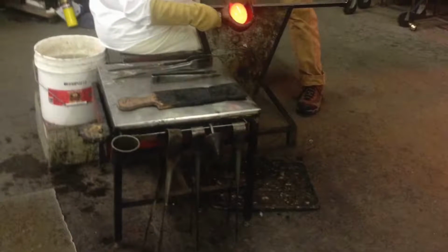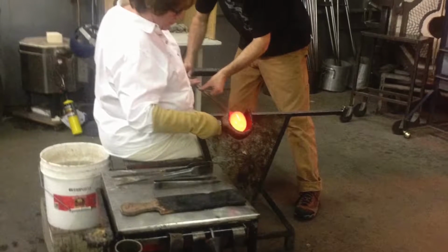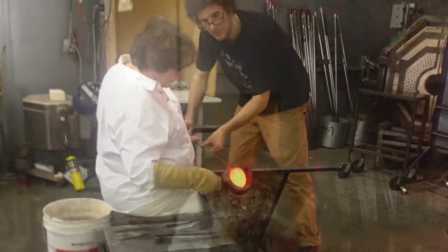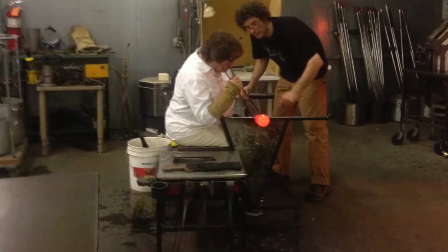Once you've started to blow the glass so there's air inside, you begin to shape it evenly in a wooden circle block that has been soaking in water and is nice and wet. You have to roll the pipe back and forth smoothly while you use the block to shape and even up your blob of quickly cooling glass. By the way, that red-orange blob is going to be my blue bowl. That's how hot it is.